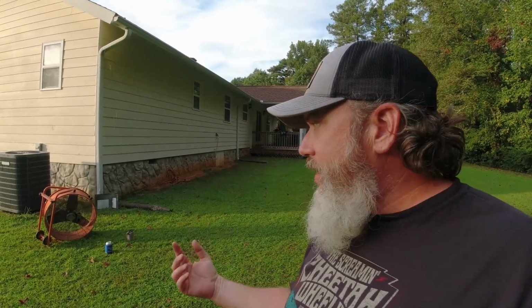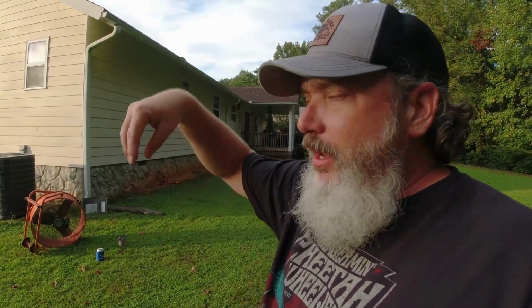Basically, I wanted to show you in this video that in a pinch, if your fan's not working, you can throw a fan on top. But if you have the fan blowing up where it's trying to suck air out of the compressor, I tried that first, and it overheated my fan motor, and I had to turn that off, let it cool off, and flip it so it's blowing down in the unit and out of the coil or condenser, and it worked fine like that for a while. So it's just a quick fix for a failing air conditioner.